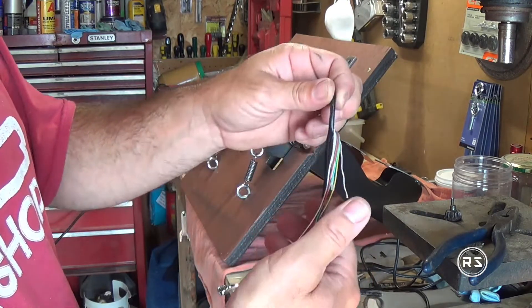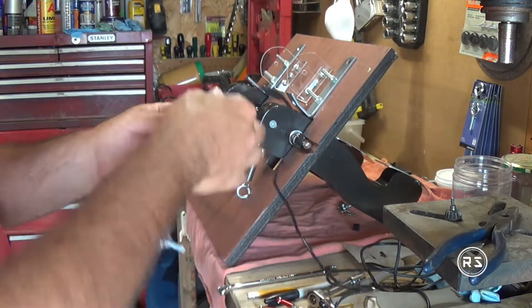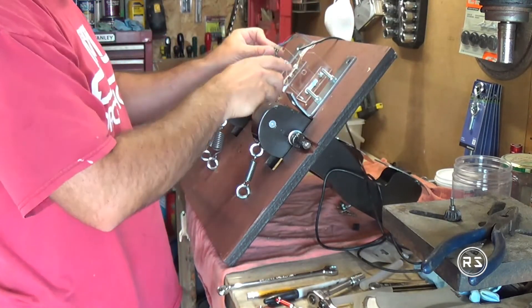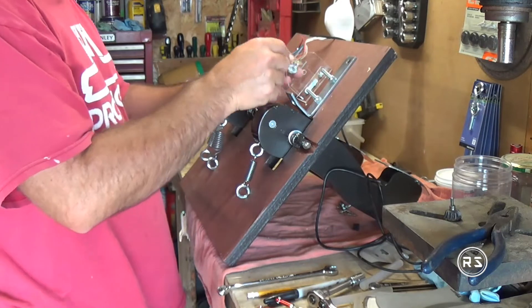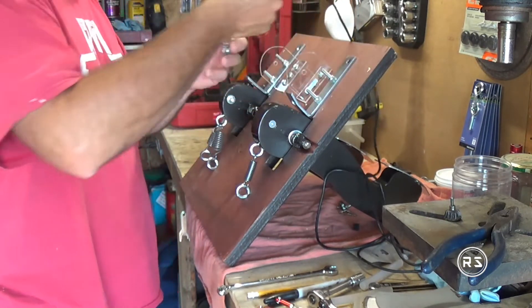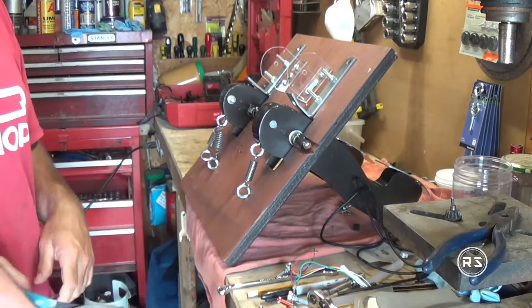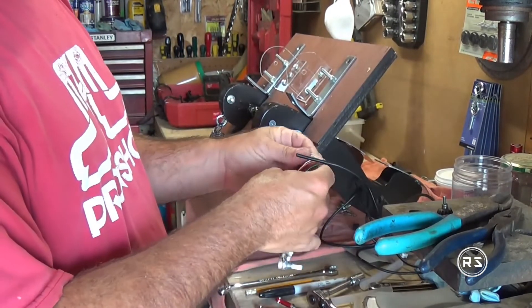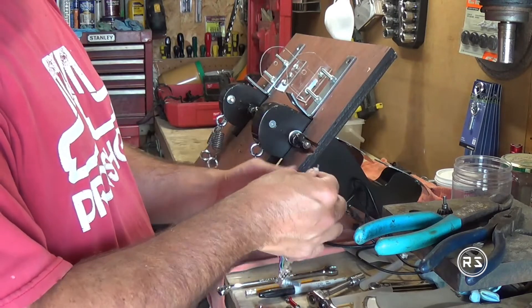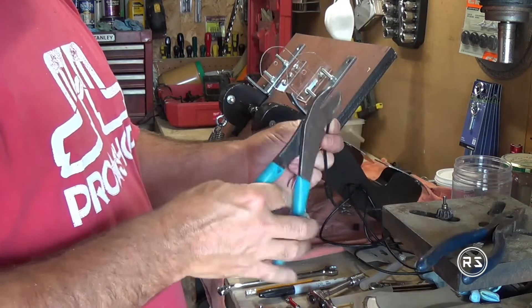After you get wires as long as you need, you can cut the skin and tape it together so everything will stay solid and you won't break any wires. When you cut the skin, make sure to cut it long enough so you don't nick any wires with your pliers. Keep your cutters far from your wires and you'll be okay.